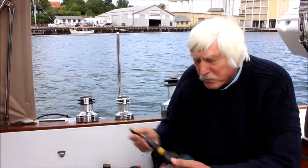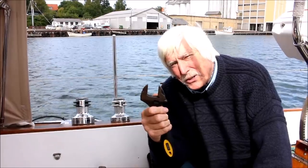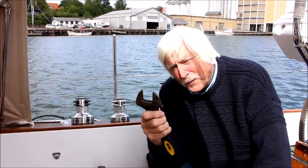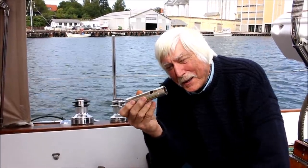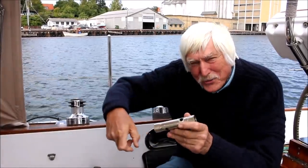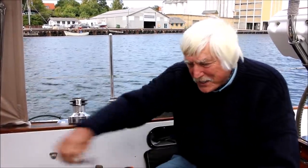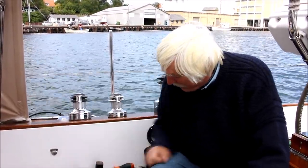And if there's a big job that comes up that I haven't got time to get my real spanners out, I've got this fella. This is big enough to do the nut on a propane bottle — so a very handy thing to have. What am I doing with an old box spanner in my ready-use toolkit? Well, this is just great if you've got a stuck seacock in an awkward place and you just can't get enough grip on it. Stick that on the handle and give it a pull — it'll work every time. There's nothing like an old box spanner.